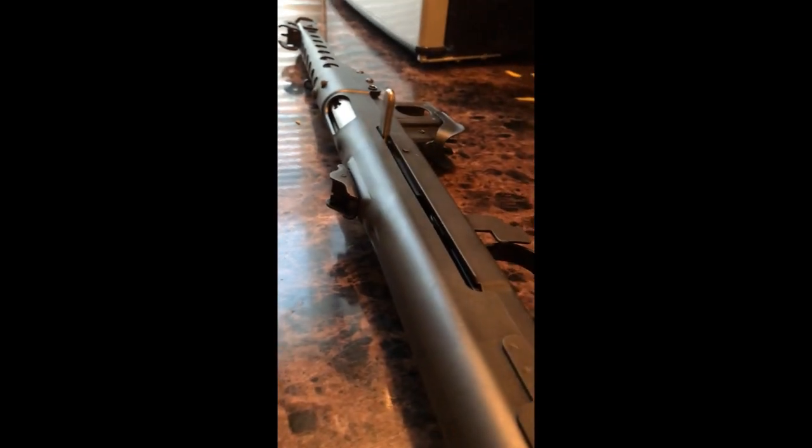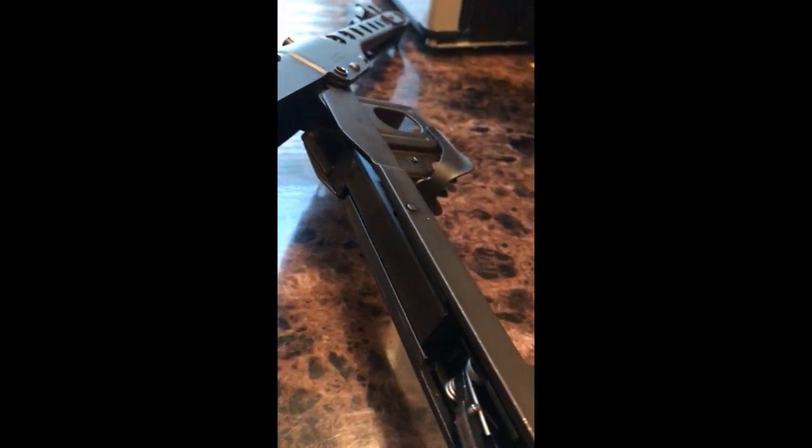The main things I've come up with: this is going to be a pain to do one-handed. I created an action block — a block of 3D printed material that fits in here to keep rounds from going back down, because you have an opening as soon as your bolt goes back. You have a clear space for rounds to go back, and I've had numerous rounds get stuck in the action back there, so I made this action block that goes in there and prevents that.